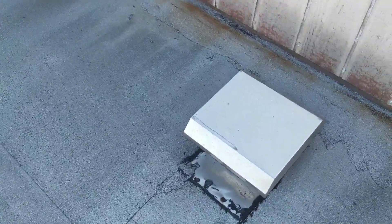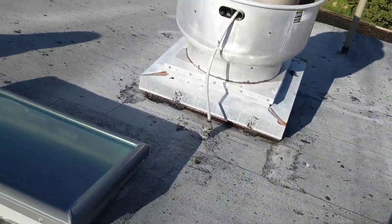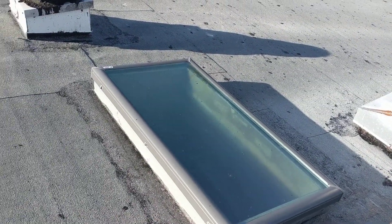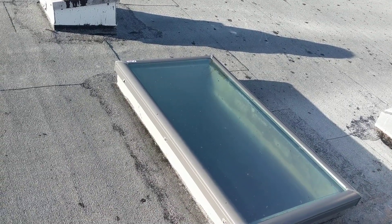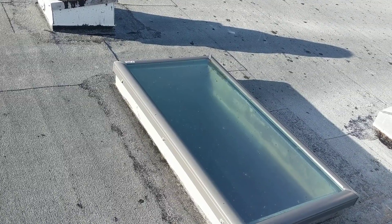The same condition applies to a variety of locations. There are maybe two locations where that condition does not apply. This skylight was installed in an incorrect orientation and/or without a cricket. We'll detail what a cricket looks like in a later portion of the inspection report.